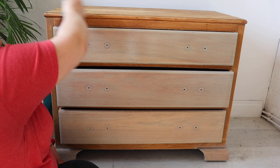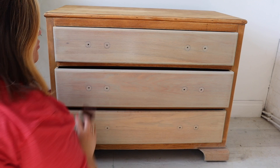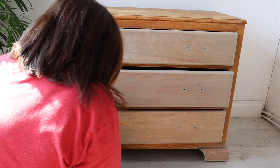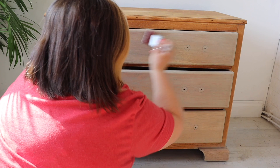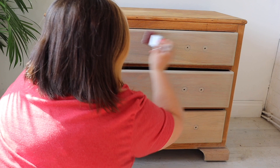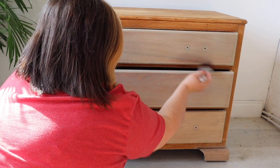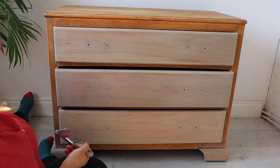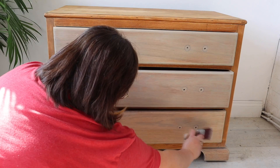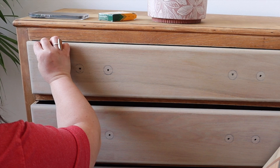I'm doing this for two reasons: first, because the built-in top coat is no longer effective since I diluted the paint down; and second, because I'm going to be doing a hand-painted design on the front. If I make any errors I need to be able to rub them out with a damp cloth, and having the paint wash sealed means it won't be affected underneath.